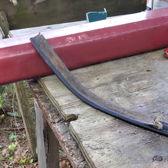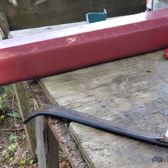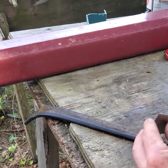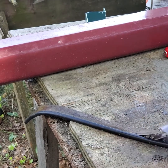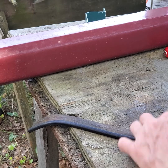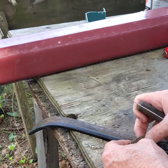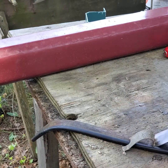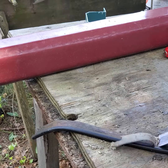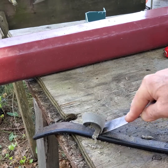So all you really need is a good hard scraper — just hold the gasket down. What I do is get it really sharp, use a stone or a grinder if you've got a good one. It's a foam-based backing glue, it looks like, that's been on here for 15 years. You just take that scraper and work it along like this, and it'll take it right off.